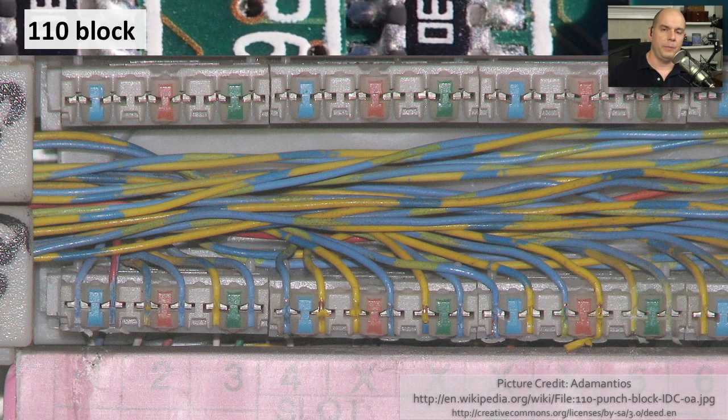Once you're done, you have a picture that looks like a 110 block with all of the individual wires punched down. You'll notice that the connectors on the wiring block push right into the insulation around the copper, making the copper connection. So now you have an electrical connection because you've pushed it down into the wiring block. Notice the wire is trimmed off as well — though you can see here that one piece didn't trim off very well, but most of it has been trimmed just fine.